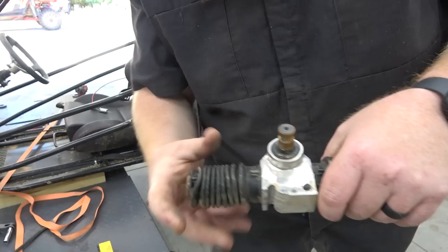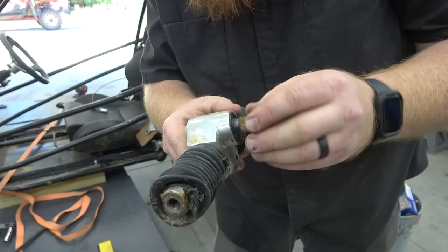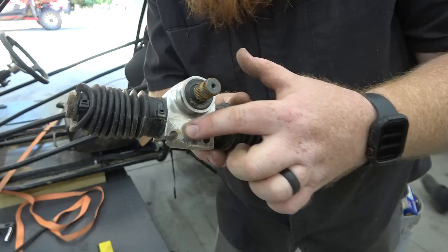While Rand Man was working on the back, I took that rack off, and you can see what happened. We didn't have it supported from the top, which points towards the driver. Where we didn't have anything supporting it, all the pressure was going down here. That's the problem with all these racks, even the steel ones: this is the weak point.